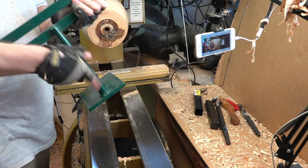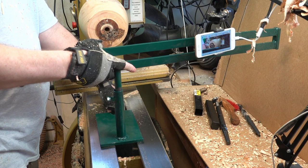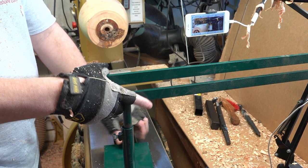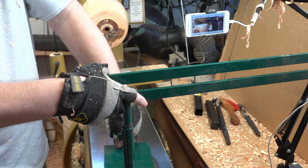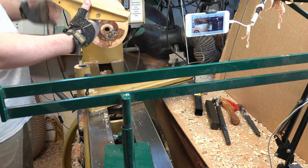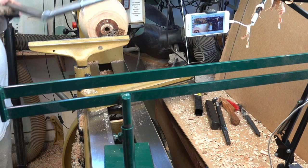With the instructions read through, now it's time to set up the backrest. Take the flange underneath and move that between the bedways in a way that it's going to lock the backrest down with the star knob. Position it with the long arm of the D-rest on the right side of the lathe — the far side — that's where the D-handle is going to move the most. Once that's in place, get your tool rest in place and then we'll move on to the handle installation.